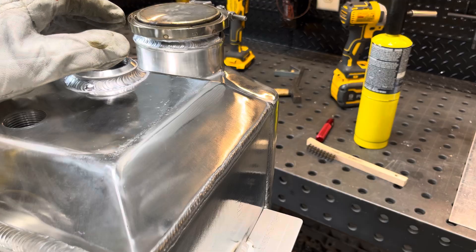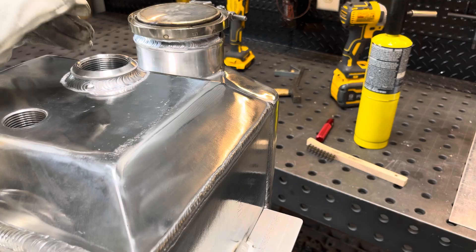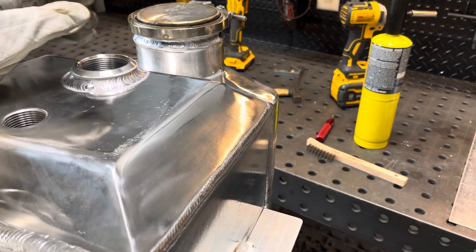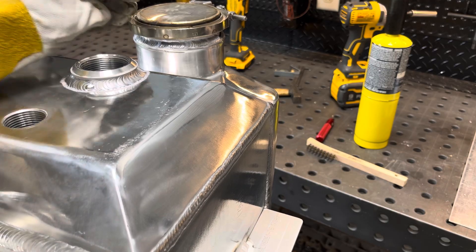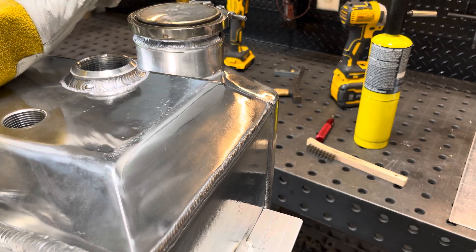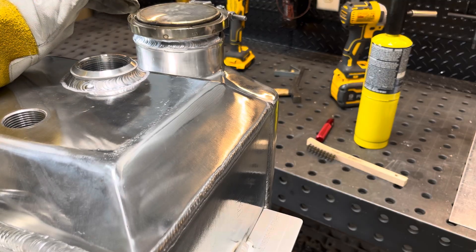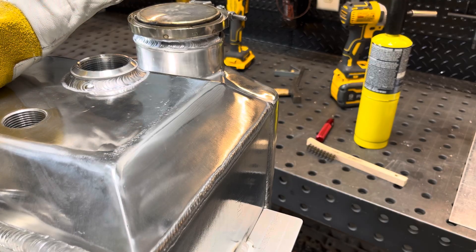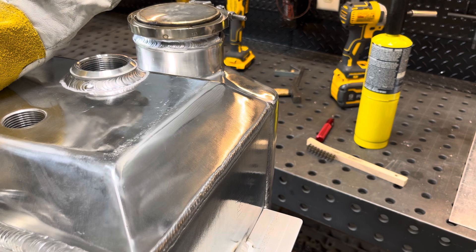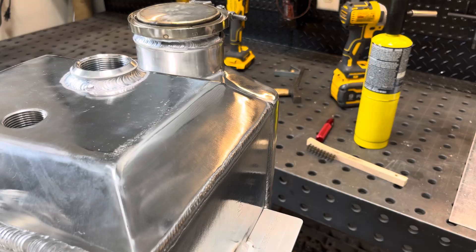On these, you know, this being a cast, it's dirty. I cleaned it as good as I can but it just fights you the whole time — you guys that weld aluminum know that. I ended up running 185 amps on these v-bands. I'm not using it all; I'm kind of working the pedal. The frequency I ended up at was 165. I don't know what it is about the Prime Weld machine, but it seems like 150 to 165 is its sweet spot on frequency for stuff like this — you just get a really nice arc.